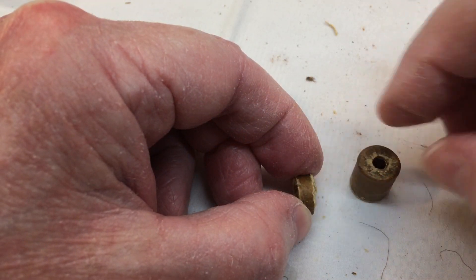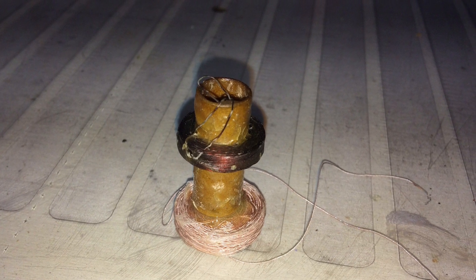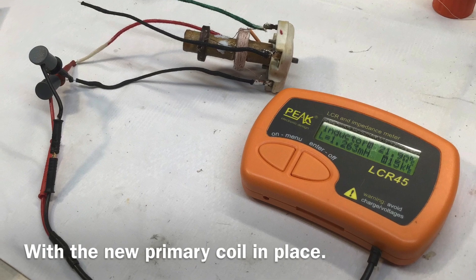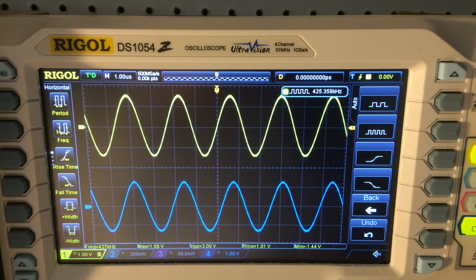There's the section cut out, along with the bottom that attaches back to the variable capacitor. Getting some epoxy out — you can see it setting up on the first section. Doing a little rust removal on the screws that adjust the trimmer for the variable capacitor. Got the can cleaned up and new lead dressing in place. Doing basic inductance testing — the DC resistance is different due to the winding, but that's no harm — and ensuring the transformer is wired back correctly in phase. You can see the primary on the bottom and the secondary on top in yellow. The frequency itself isn't critical at this point because we're not loading the transformer correctly, so stray capacitance is shifting the frequency.